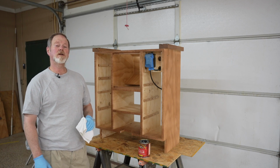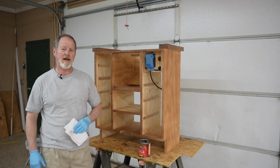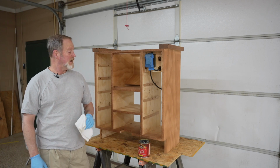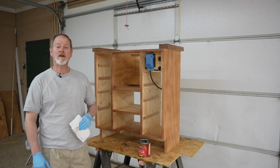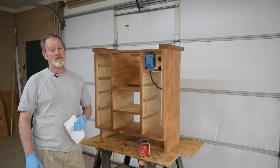I'm also not going to wipe on the tops of the runners. We'll put a coat of wax on those so they'll slide real nice. After we finish this piece, we'll just move on to the other parts until we're finished. And after that, we'll give it a light sand and put on another coat.